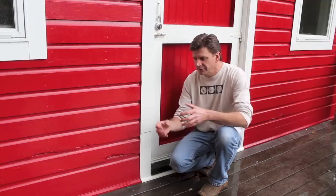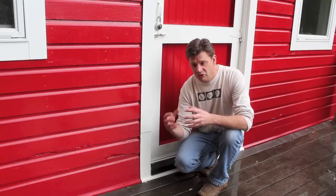Now there are a couple of things you need to know. One is you're really not supposed to paint Azek a dark color because unlike wood, where wood expands and contracts with moisture, Azek expands and contracts with heat. So if you paint it dark it's likely to expand. But since this area of the barn rarely gets any direct sunlight, I felt like it would be okay. For the most part you should really paint Azek a light color.